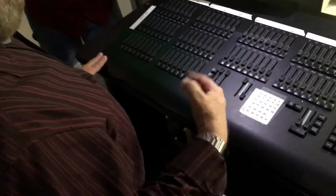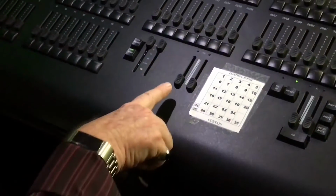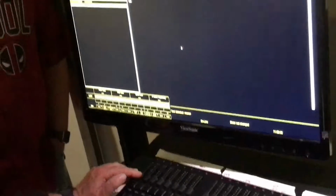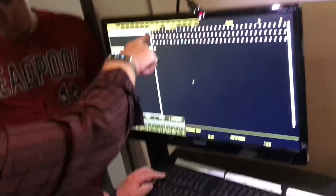Okay, so let it do its thing. Now we want to turn on the A circuit. So we're just going to make sure the triangle is up to full. Now there's power to that bus. I'm going to bring up circuit number 1, which this light is plugged into. So bring it up to full. You see the percentages coming up.